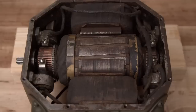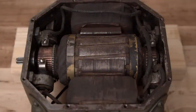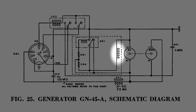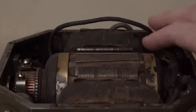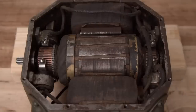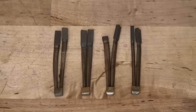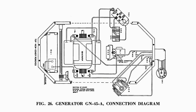The generator section itself comprises a rotor, two field windings, and a pair of brushed commutators. The field windings function as electromagnets. When the mechanism begins to turn, residual magnetism induces a current in the rotor; some of this current flows through the field windings, which generate a sustained magnetic field as the rotor continues to turn. An alternating electric current is induced in the windings, and this is where the commutators become important. On either side of the commutator rings are sets of carbon electrodes called brushes. The brushes change the polarity of the current from the rotor depending on its position, so current flows in only one direction once it leaves the rotor — they are mechanical diodes.